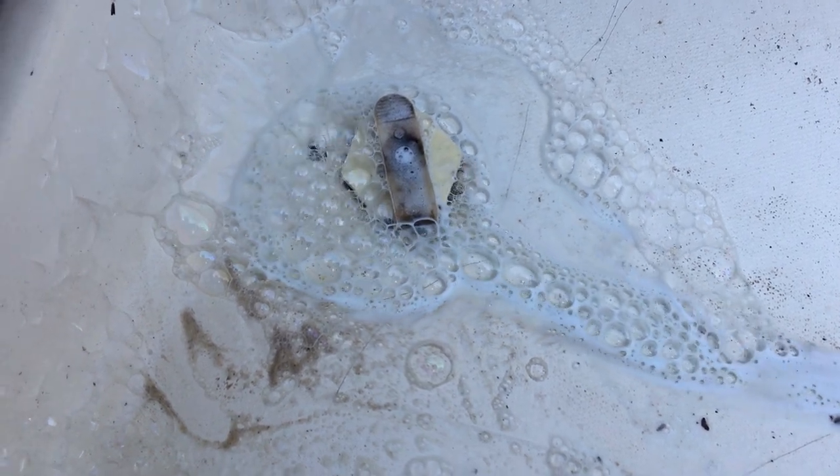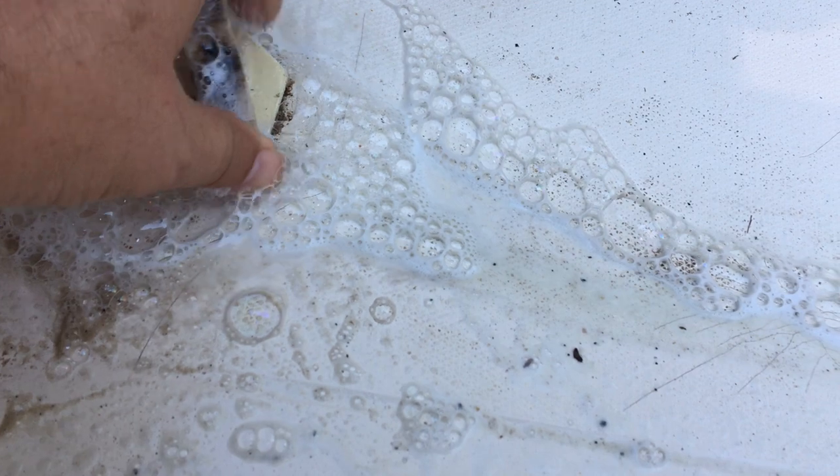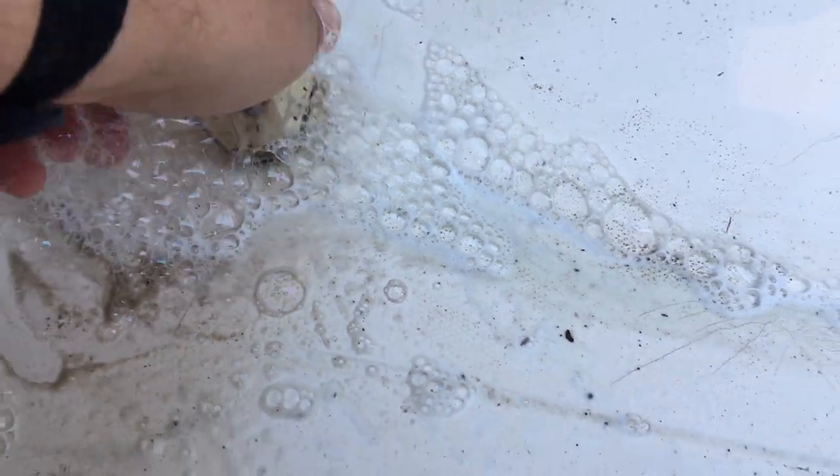Skipper's favorite one is down here on the baler. There's a seam between the bottom of the boat and the cockpit hole and the air is coming out there, so we'll take that baler out, squirt some epoxy in that hole, and fix that.